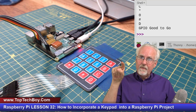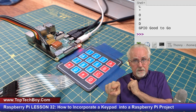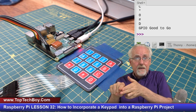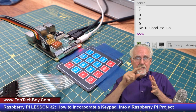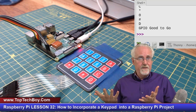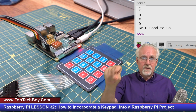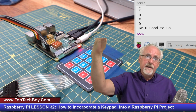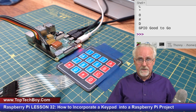And that is, if I go through all the buttons and 3 is pressed, when I go back through the buttons, if 3 is still pressed, I don't want to take it unless it's gone through one time with nothing pressed. Okay, so I don't want to just put 3, 3, 3, 3. I only want to register the 3 if I have a what? If I have a no press condition.